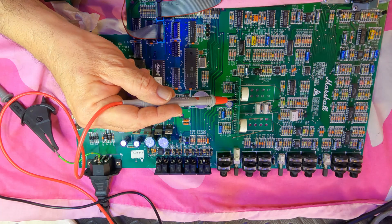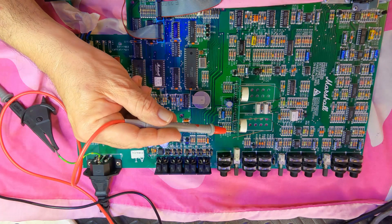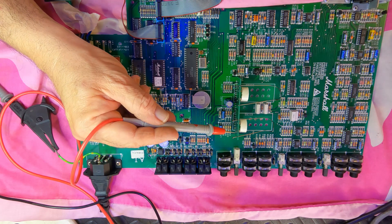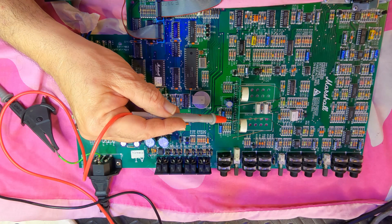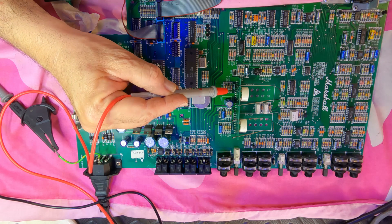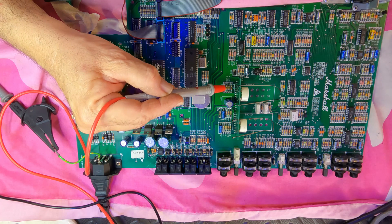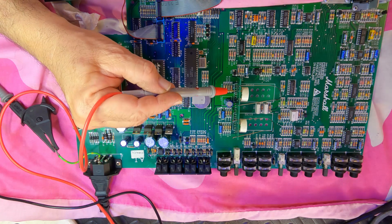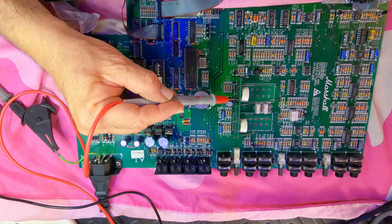Pin one — this is the plate of one of the tubes — reading 73 volts. 75 volts on the other. Should be another one — 74 volts. Okay, we're heading north. Let's keep going — at 64 volts AC on the input, the plate is now at 95 volts. Now 235 on the plate. It's looking positive.